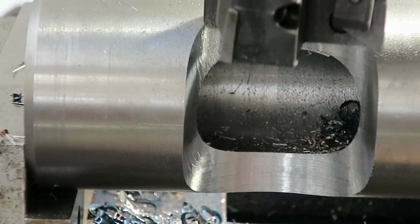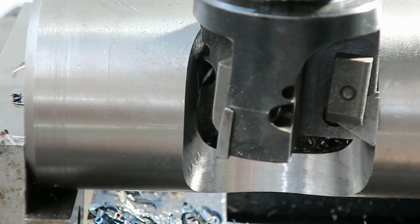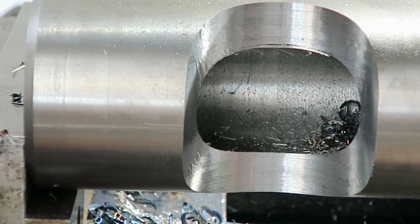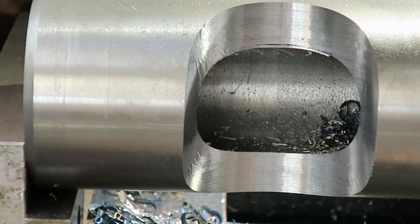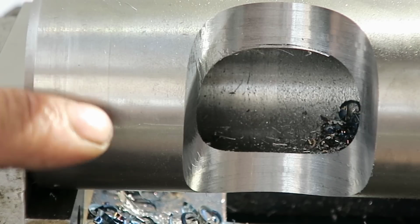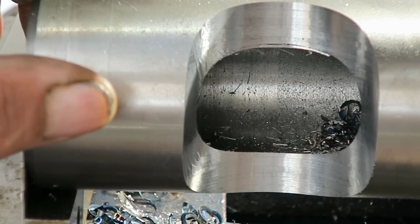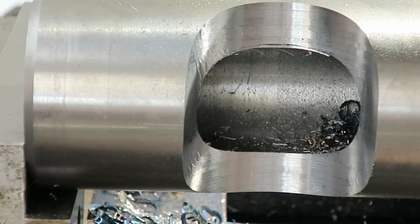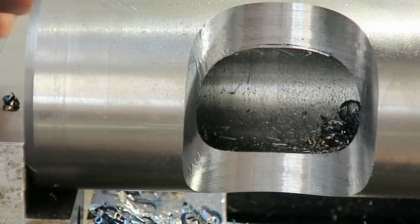So we got a 2-inch cutter in here. This is 1.9 diameter, so we're close enough. It's going to be welded on there. And we found the center and this leading edge, and we've went in and we've cut a 1-inch depth. So if we take a 1 inch off of here and a 1/2 inch off of our other piece, we should have our 1.5 inches.